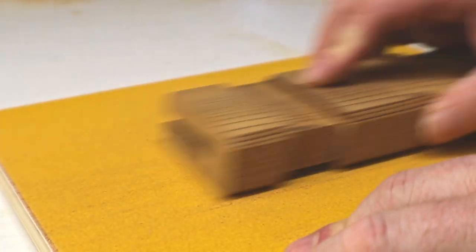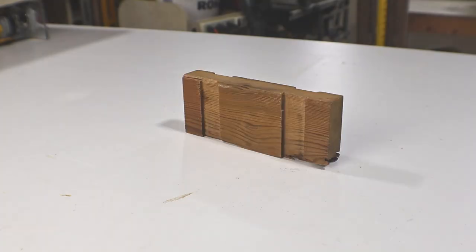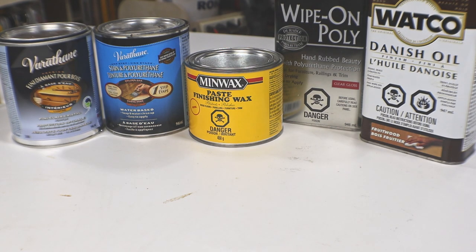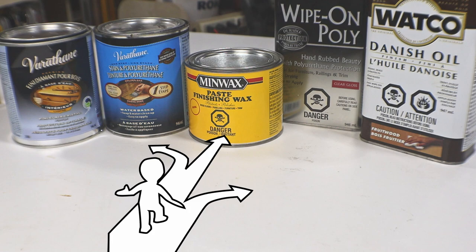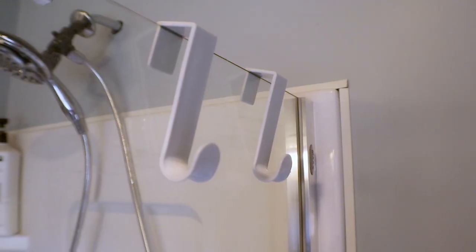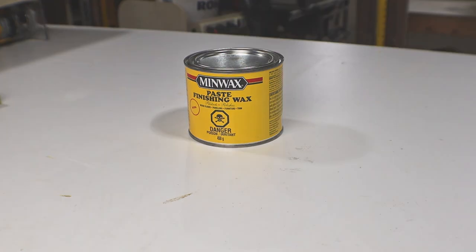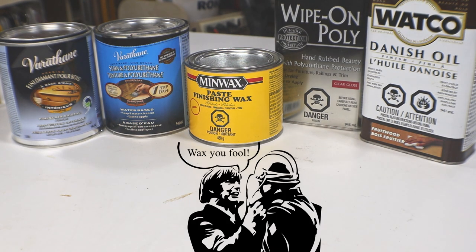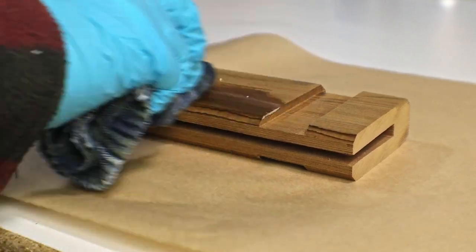I'm all done with cutting now, so it's time for a bit of sanding. I wasn't sure what I wanted to do for a finish on these, so I used a test piece and tried a number of different finishes to see what looked the best. With this particular piece of wood, all the finishes I had looked pretty similar, so that kind of made it hard to choose one product over the other. Apart from looking good, I want the wood to be protected from the moisture, since these are going to be living right next to the hot shower. I thought maybe wax would do a good job, since wax is good at repelling water. If you have any suggestions for finishing wood that will be exposed to moisture, please let me know in the comments below. I'll let you know how well this wax holds up over time. I do like the look of the wax, and it's pretty simple to apply.